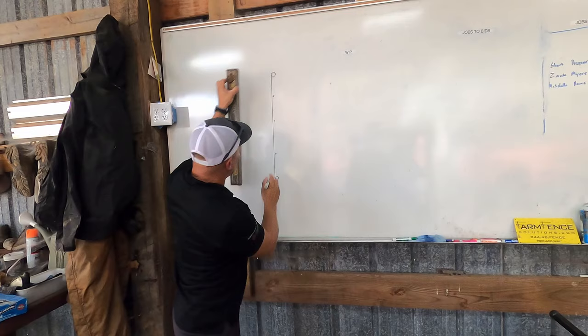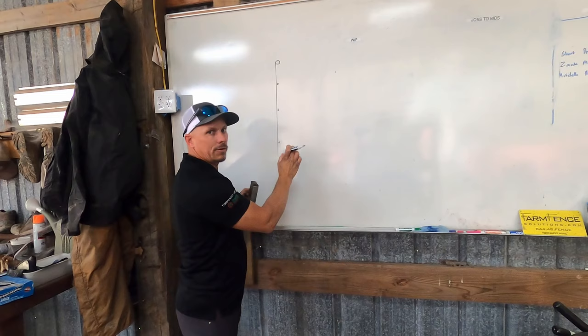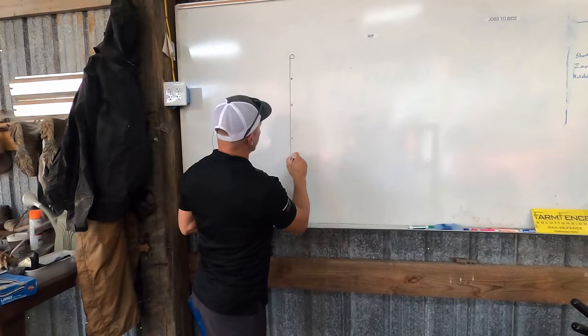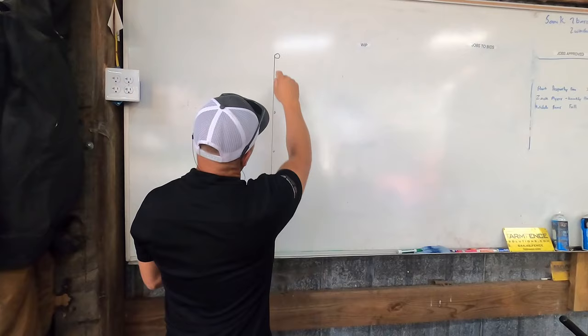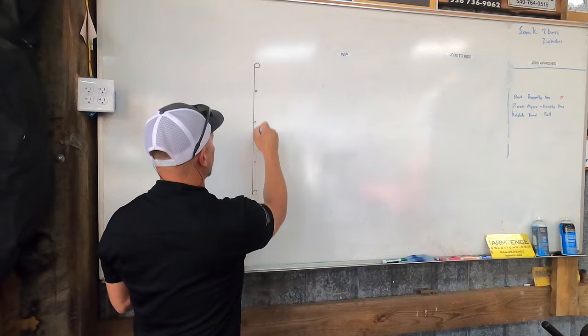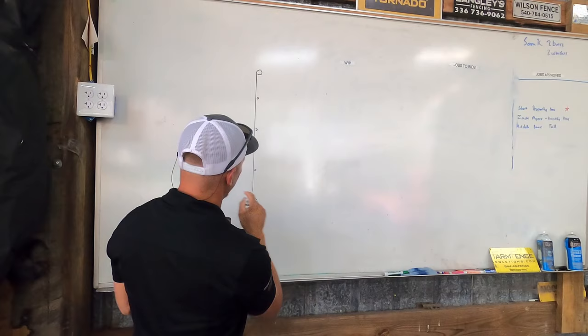You can see that if we sight these in, they're going to be in from the line because of the difference in diameter, so it makes it more difficult for us to side off all the faces. In an ag fence application where all your posts are roughly six inches, you run into taper issues as well. Everything on chain link is lined up with the center of the fence line, not the face, so you can deal with your different diameters of pipe.